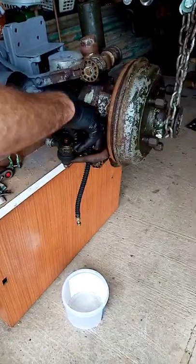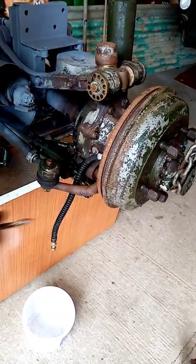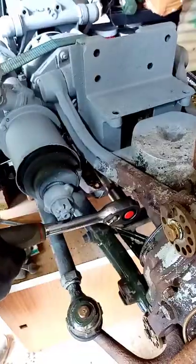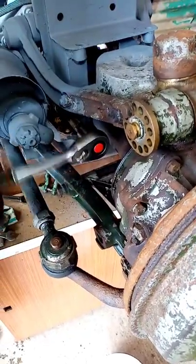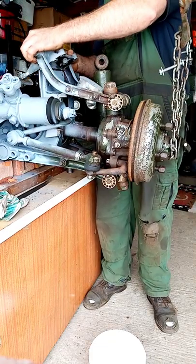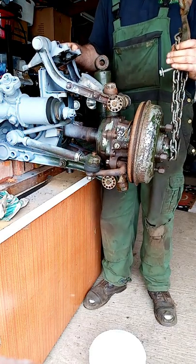So we've taken the bolts out of there and the ones down the back, so this lot here will all flip over. We've undone the top arm mount, so we simply fold that out the way, and let the engine crane down a bit. We've got it supported on the engine crane for a minute because we don't want it to drop out and drop out the master spline.